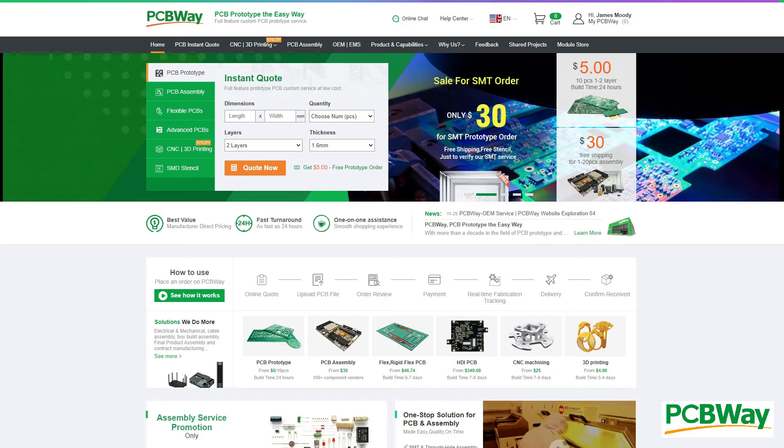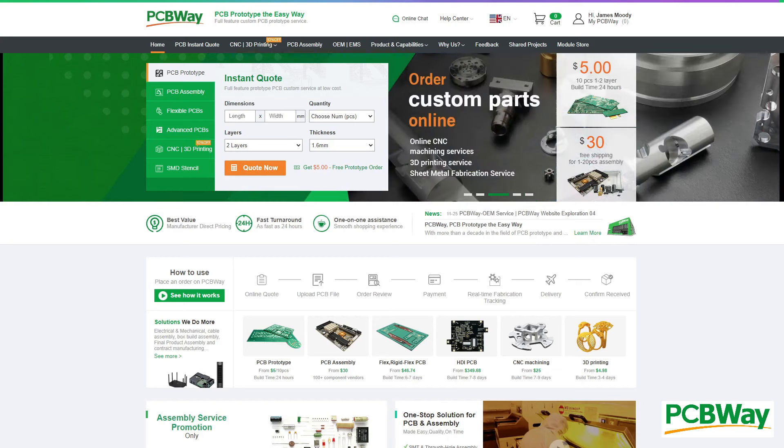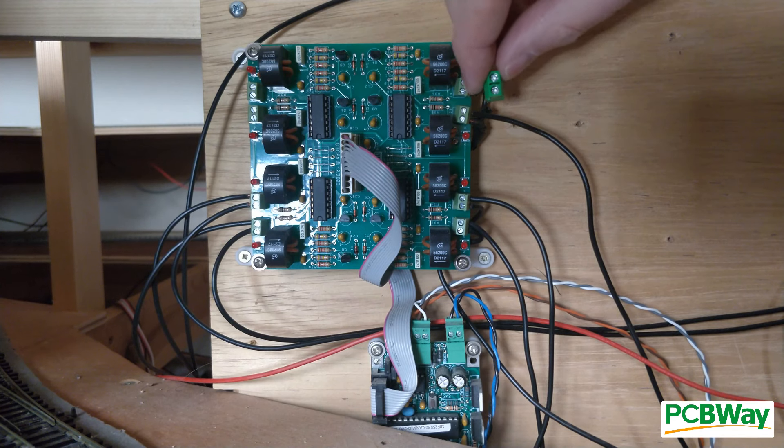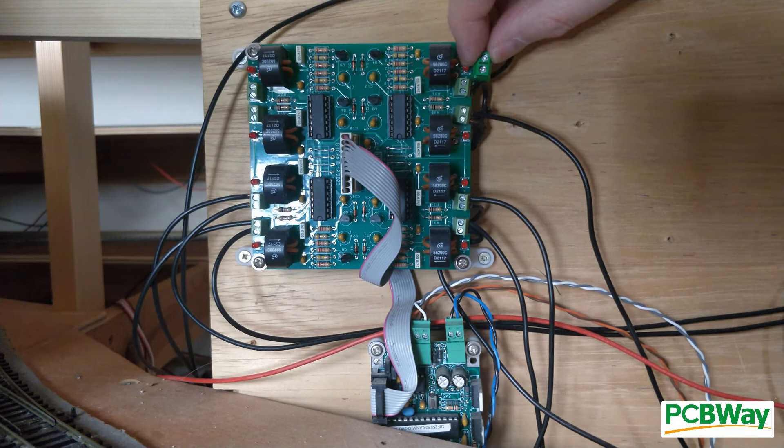If I were to do that, I could then order my own PCBs from PCBWay. However, the existing PCB is quite tightly packed already. A hundred millimetre square is a magic size in the pricing structure for ordering PCBs, so I really don't want to make it any bigger. I've got to find the space I need for the bigger terminals and the power distribution without making the board bigger.